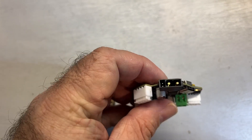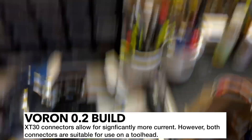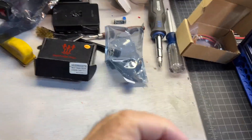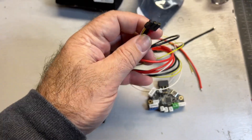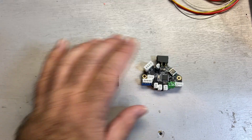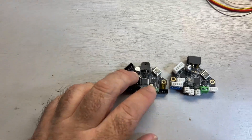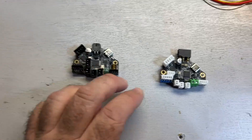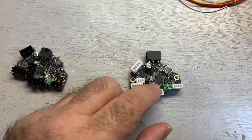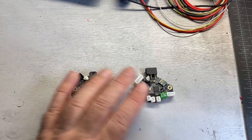The BTT uses the new XT30 plus 2 connector — I'd never heard of it, but it seems like a better connector. I've used XT30s on drones before; the XT30 plus 2 has an additional two-pin connector. The Mellowfly does include the connector with wire that should be long enough. The BTT board also has buttons, which makes it really easy to jump into boot mode, reset, or load firmware. The Mellowfly is more challenging — there are no boot pins, and getting it into DFU mode requires shorting a small resistor, which isn't ideal.